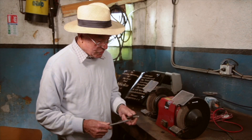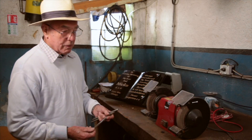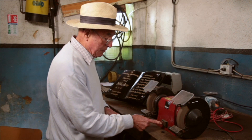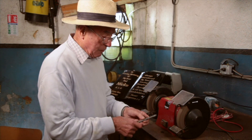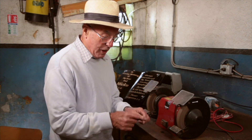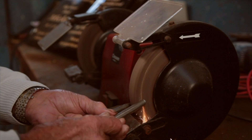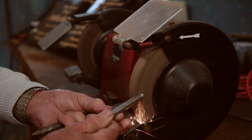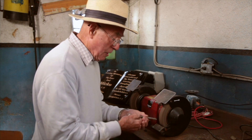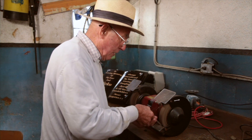When I started serving my time first, we had an anvil and we had a hammer and we used to make our own tools. What we used to do was make the splitter — we'd make the head of the splitter first. You don't have to temper the head; you leave it soft, because if you temper it, it'll break and it'll fly. So we used to make the head of it, and that's the head of it there.